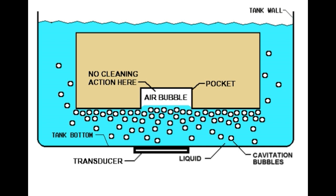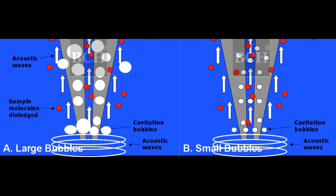We need to decide what kind of ultrasonic machine to use. If we use this configuration, the ultrasonic force will clean the surface of the printhead. Also, if we fill the printhead with liquid such as ink, the vibration will knock off debris inside the nozzle. So outside cleaning is done by vibration and cavitation bubbles, but inside cleaning is only done by vibration.